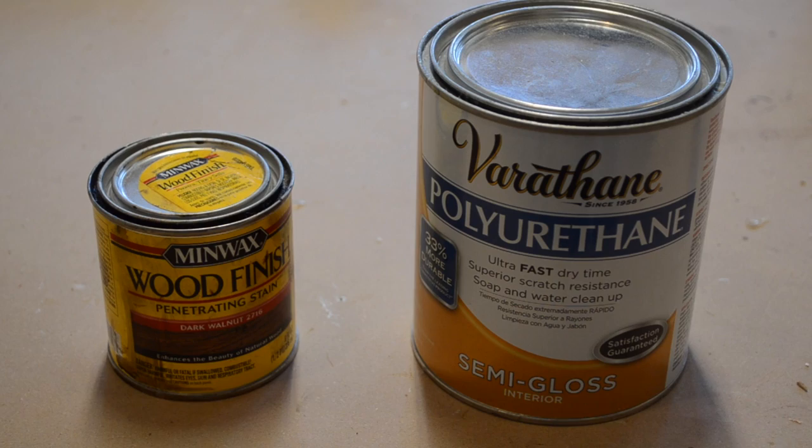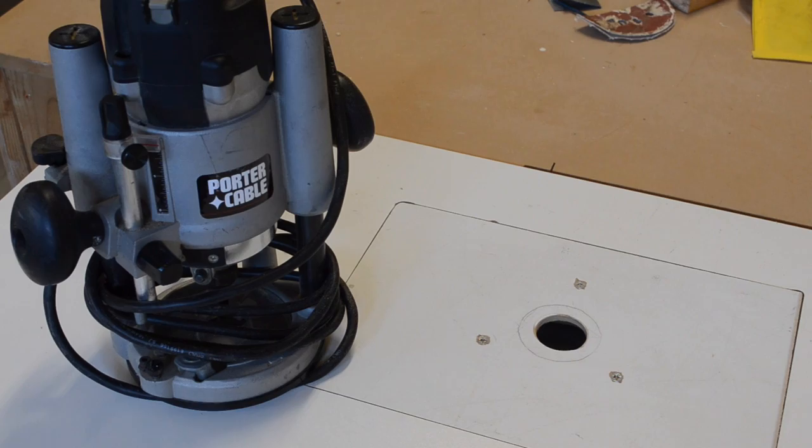To make this, we'll need some sort of cutting tool for the wood, a drill with a 1/8 inch drill bit, a 1 inch drill bit, a bottle of liquid soap, and some stain / clear finish coat. You'll also need an orbital sander, wood glue, and a router is optional.